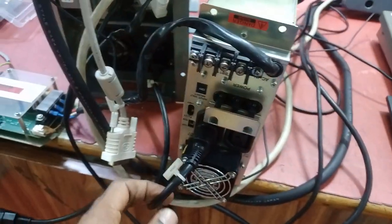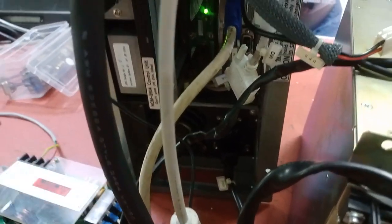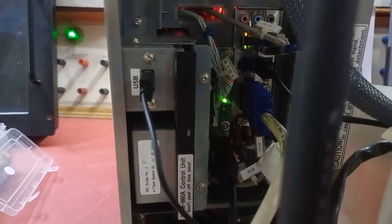It consists of the motherboard, number CMC1385. It has one power supply for the SRB and other connections, and a power supply for the motherboard, a usual SMPS power supply. The dongle will be inside the JRC dongle box for the chart and unit. The ECDIS is booting now.